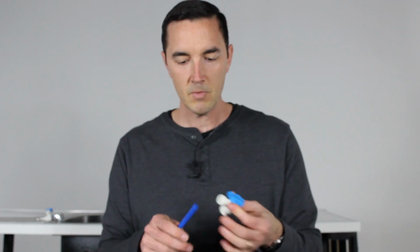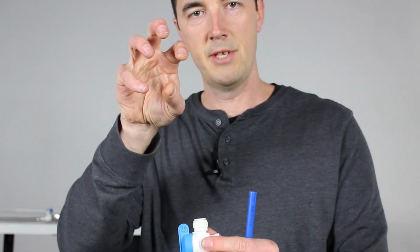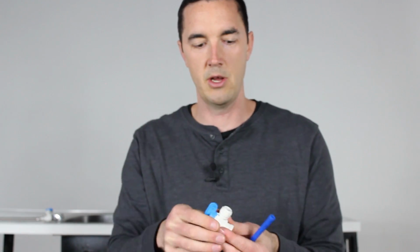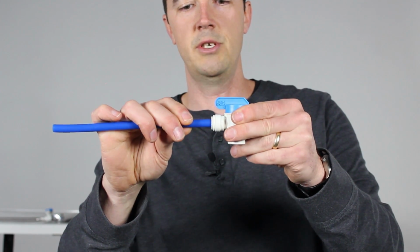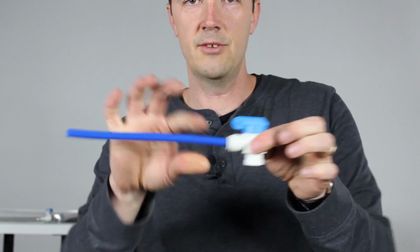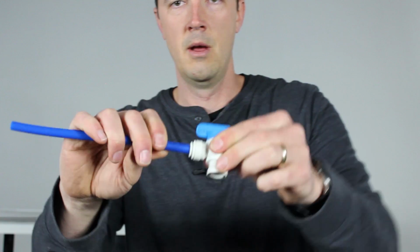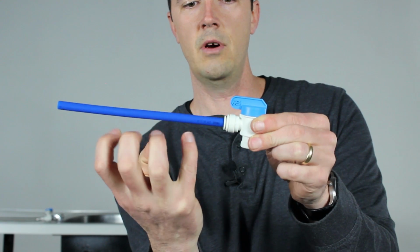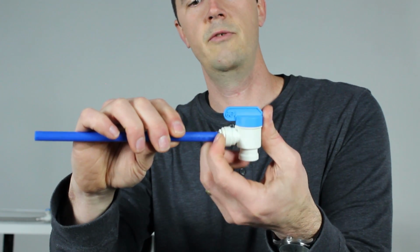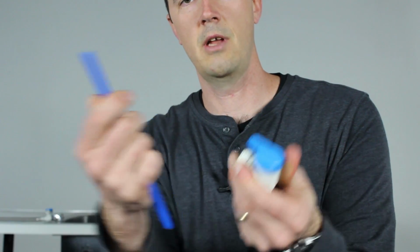How to get the tube out in case you want to move it or you need to adjust something or whatever, right? So the way these work is, if you kind of look inside of these, you'll see there's a kind of jaw setup that'll clamp down on the tube when it goes in there nice and secure. And so put some pressure on the back end of these, no matter where they are. And you'll take that tube and you'll start to push it in, and you'll feel it kind of stop a little bit, and then you can seat it again. It's almost like a double push. That means you've got a good seal, and you can't remove it, right? And you'll notice there's this collar, kind of the inside piece. That's the clamping part, that's what's clamping onto the tube. So you use 2 fingers, push that collar back towards the valve, and that'll release the jaws and allow you to remove the tube.